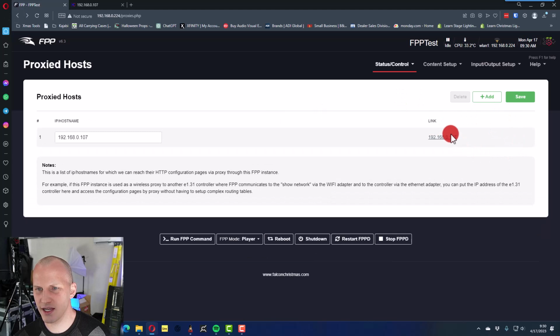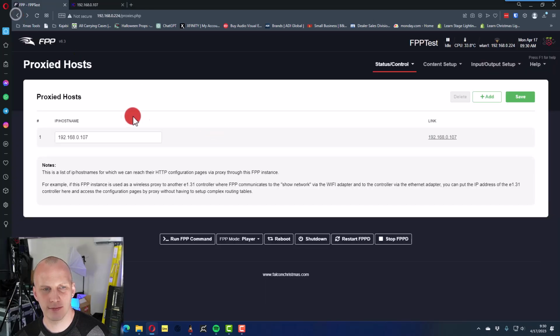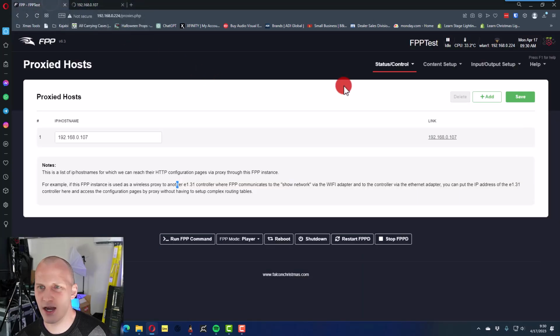So we save that. I know it does have to restart, I believe, the FPPD in order for that to work. And yes, my guess is that this is not working because we're in the same IP address range. So I'm going to pause. I'm going to change my IP addresses, and then go ahead and update this, and I bet it'll work for us.